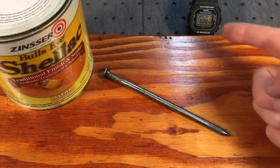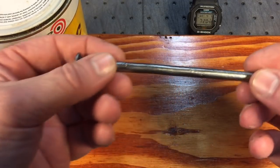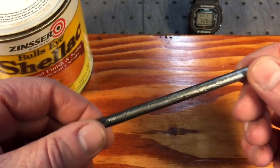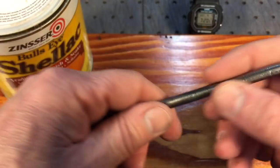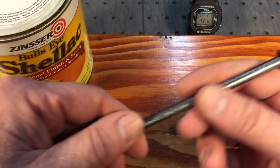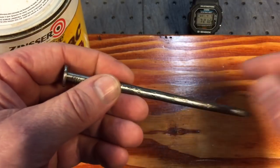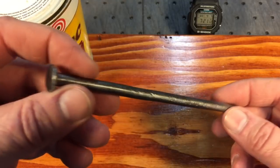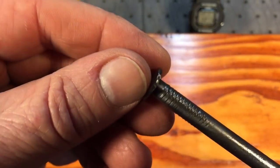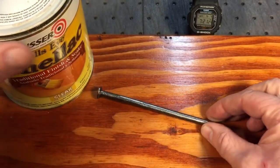We just took the nail off the furnace — you can see in real time it's been 20 minutes. This is dry to the touch. Now look at the coating on here. The coating with shellac is so thin, crystal clear — it doesn't yellow, but it's very durable. After this dries, a day or so, I've already put light oils and WD-40 on it and nothing disturbs this. This is really good as a primer — it's fantastic. You can spray paint over this, put all kinds of coatings over this and it won't interfere or cause a problem. You can see it gets in all the grooves and we just put it on with a rag. It's just a great finish.